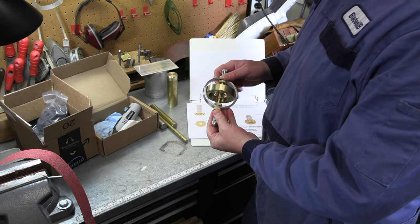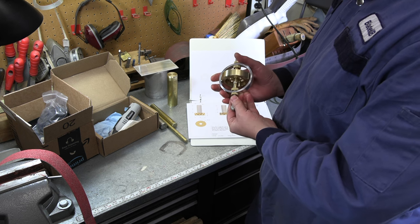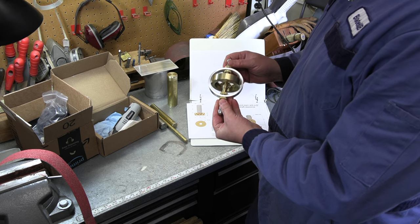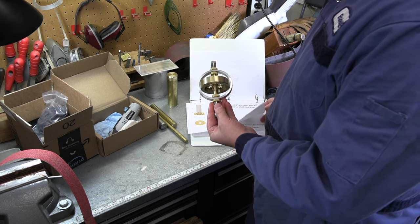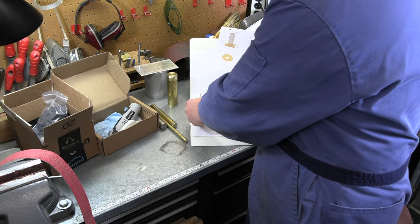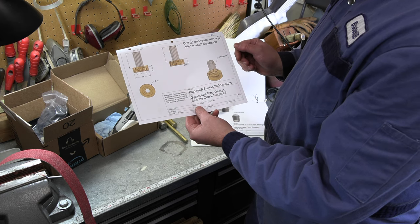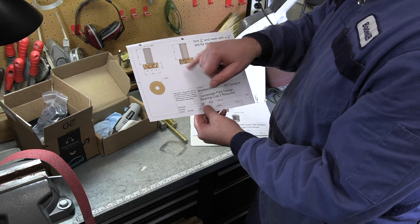All right, YouTube, it's been a day. I am clearly disappointed with the performance of this yesterday. It didn't work out quite how I thought it was going to. So I got thinking about it overnight, and I think I may have figured out my engineering flaw in doing this. Honestly, if this turns out to be what it is, it's pretty much a bearing 101 mistake that I made. So I did not put any kind of a relief cut on the back end of this bearing.